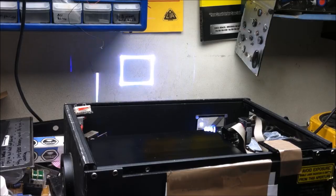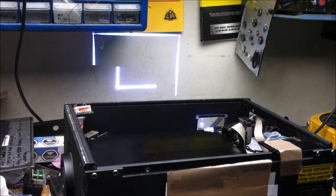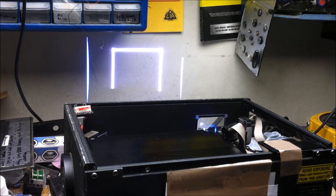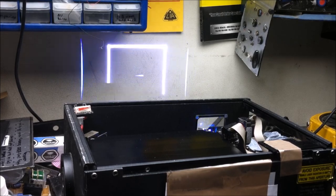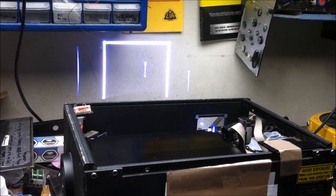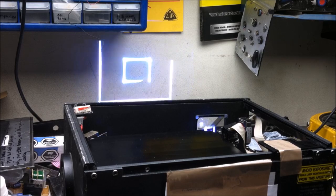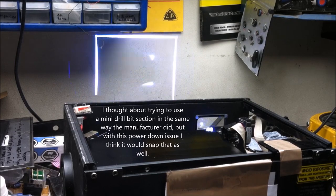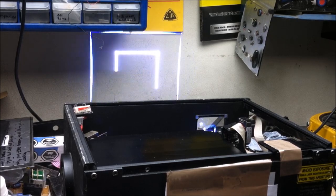It looks to work. Okay, so remember to say we can make it better or worse. There's a third option, we can leave it alone. So I've tried a couple of things, none of them really worked very well. The first problem is that there was a kickback in the Galvo, which broke the original pin that was in there. So I thought, let's try another design. I tried one pin, wasn't strong enough, just bent around the shaft. I pulled that one out, I put in a hardened steel pin, and what ended up happening is that pin just went right through the rubber stop that I put in there, and then it proceeded to hit the optical sensor on the bottom. And that just happens when the laser is powered down and there's a kickback in the Galvo's magnetic system that makes it torque over.